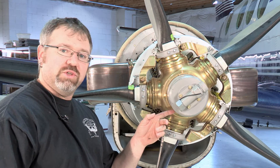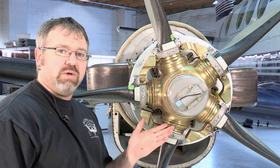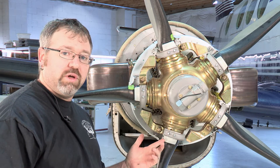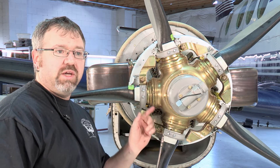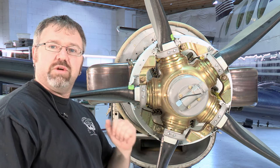What we have here is the Czechoslovakian-built Avia 510 series propeller. As part of the Power 90 program, you're required to pull the propeller blades out of the hub at 800-hour intervals to check for corrosion among the threads. So, let's get started.